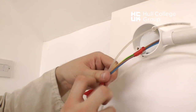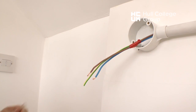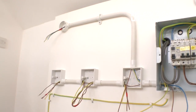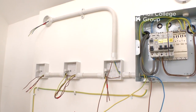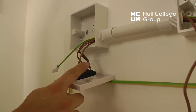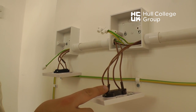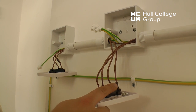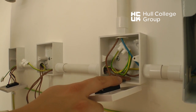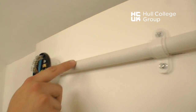The draw wire can now be removed and we can now connect up all the accessories. Here we see that the feed comes into the one point, then via the strappers it goes to the intermediate, and then from the intermediate it is connected to the first two-way. From the common connection of the first two-way, it goes all the way to the L position of the lamp holder.